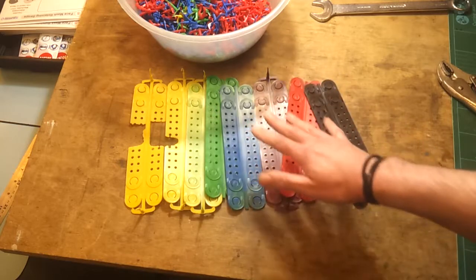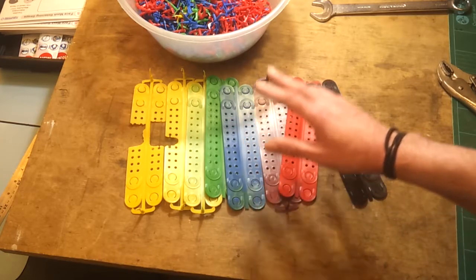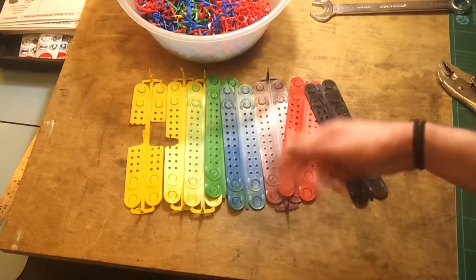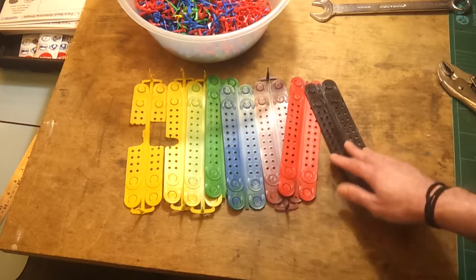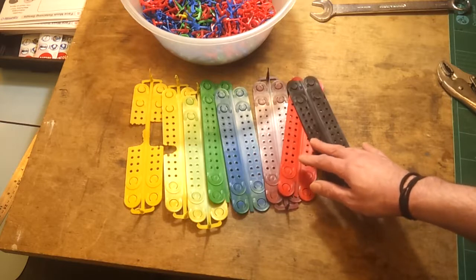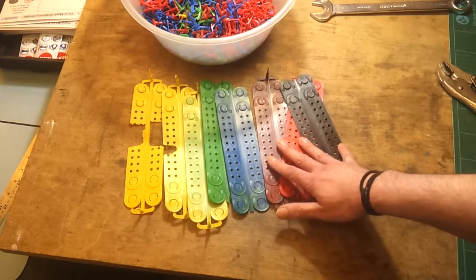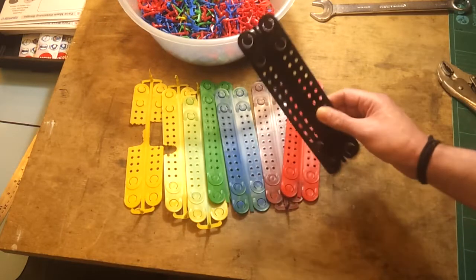If I'm doing significant batches of particular colours, I tend to keep the colours separate and re-grind those in a similar process — starting with the lightest colours and working my way through an appropriate colour wheel — so I'm getting back pretty much pure colour granulate which I can then mould again as colour. But if you've got it all mixed up like here, you're going to end up with mixed colourant which will come out a mucky brown if you try to mould it as-is. You just add a bit of black masterbatch and turn it all into black, so nothing gets wasted. But I've now got to granulate all of this and then probably mould another batch of black with it.